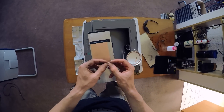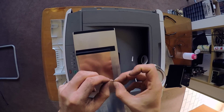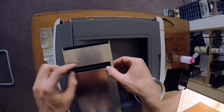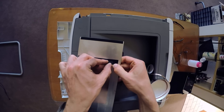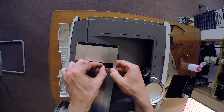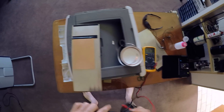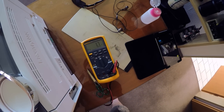Here's one of the most important things I've learned way too late: the surface you want to print on should be grounded, and I'm doing that by connecting it to the carrier with copper sticky tape by 3M with conductive glue. That stuff's not cheap but the roll will probably last forever. The toner particles are more likely to stick to a grounded surface because they have been indirectly charged to a high voltage on the photoconductor roll.